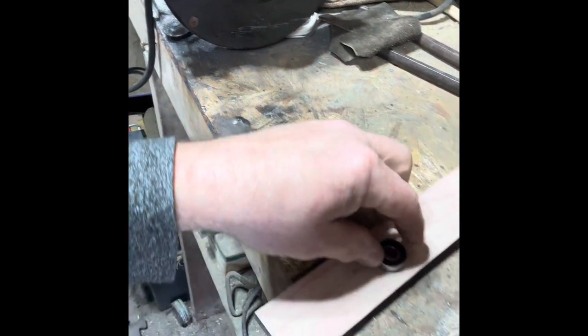I made this knife a while back, and I also bought these little bearings. I thought, if I could incorporate that into a knife — I've seen it done before. I went out to Harbor Freight and bought a Forstner bit that is the size of the bearing so it'll drop right in. As long as my scale is three-eighths or thicker, it'll sit right in. I'll just super glue the outside edge and then you'll have a bearing block for friction fire in this knife.